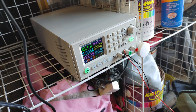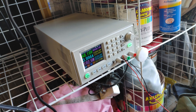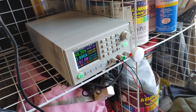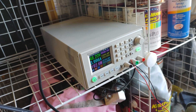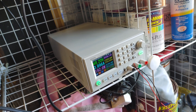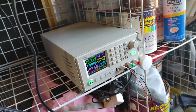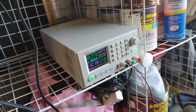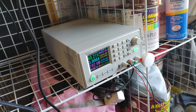I'm using 21700 Tesla batteries — the Samsung 40T. The good thing with these is you can charge them a lot faster; you can put more current safely without increasing temperature. I've got it at 4 amps for my 12S 4P setup. I could probably do 8 amps fine, because these cells are rated for 2 amps standard charge, which in a 4P setup equals 8 amps. But I always use a little less, because if you charge your battery fast it's going to degrade it faster.